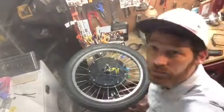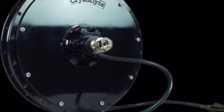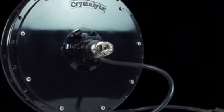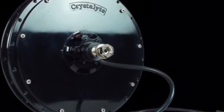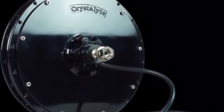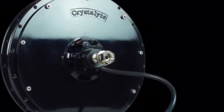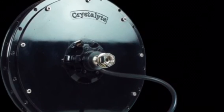This repair is complete. The motor is back in working order. It's important to note that this is a brushless, sensorless motor, so there were only three wires to repair. Frequently, there are sensors inside a hub motor and you'll end up having to deal with eight or more wires. In those cases, I'll often opt to convert the motor to a sensorless motor, which is a detailed subject I'll go into in a future video. Take care.